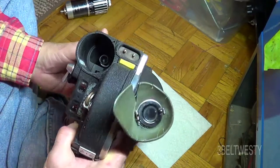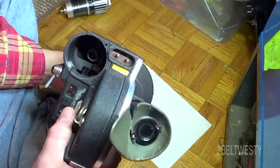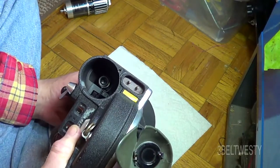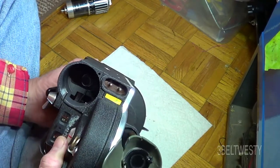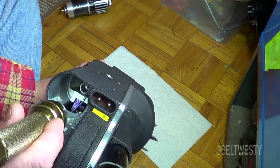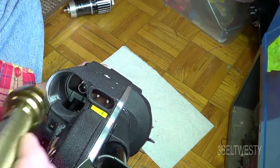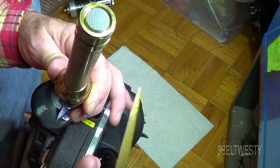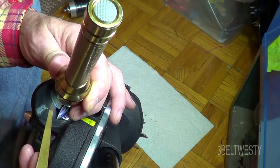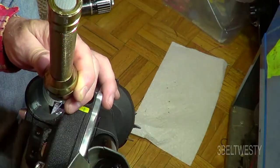If I go in there and look down inside, I can put a pair of gloves on and spin the mirror box around like this. Just touching the edge of it, what I discovered down in there is right on a gear — it's below the rubber coupler — there are some chips. I took and got in here and just removed little pieces of film that must have been from a jam, and transferred them over to a paper. I've got all these little pieces — film, sprocket holes, crud — that I've gotten out, and now it runs true with nice uniform torque.